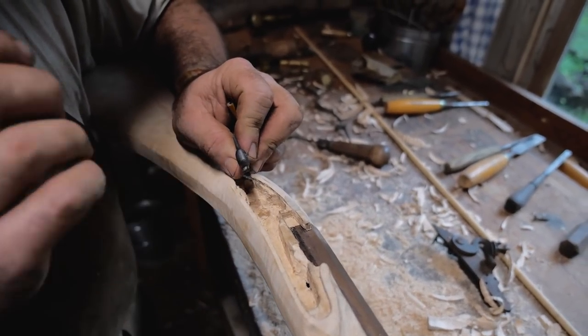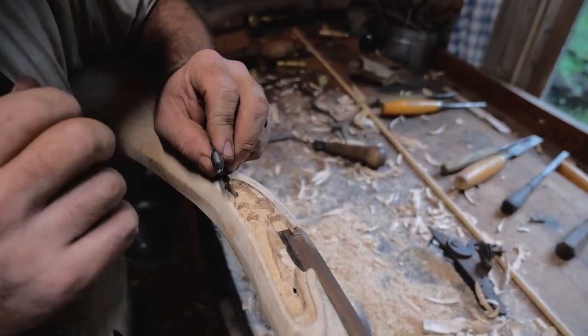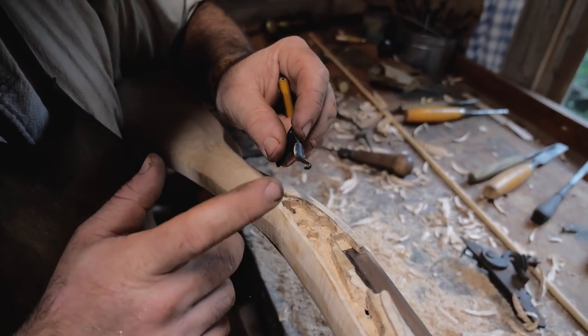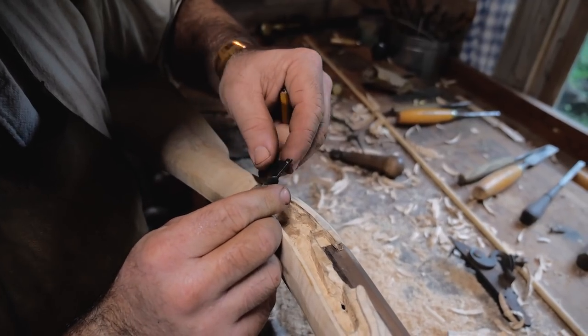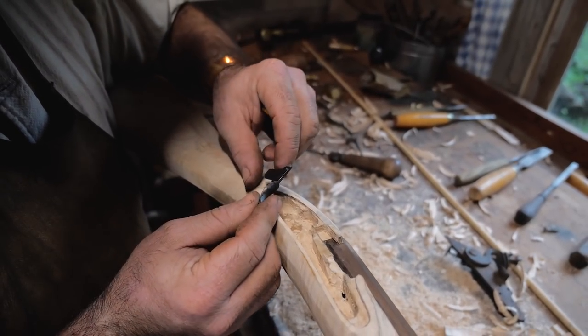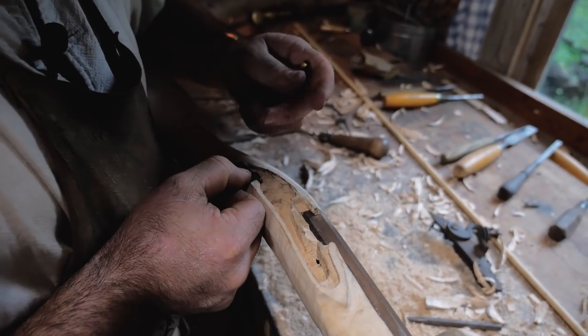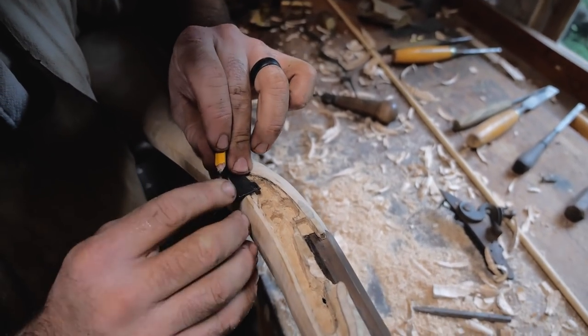You just take a piece of sheet steel and then you put it on your anvil and you start beating it with a ball peen hammer, just really light blows, and it flattens this part out to make a flat trigger. And then you hand shape all this. A lot of them were very decorative on the backside. This one's a very simple trigger, so we're going to use it, but I like to line it up here. So with your triggers, you want a little rise in them right here.